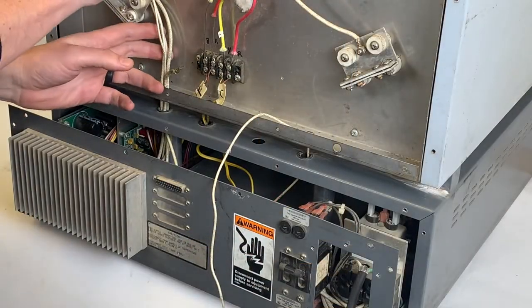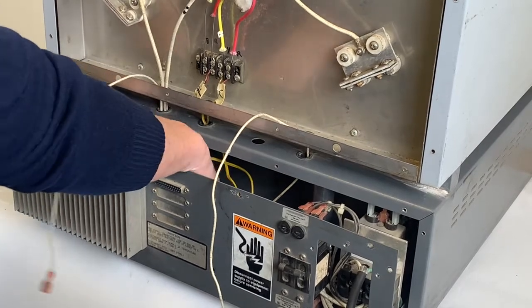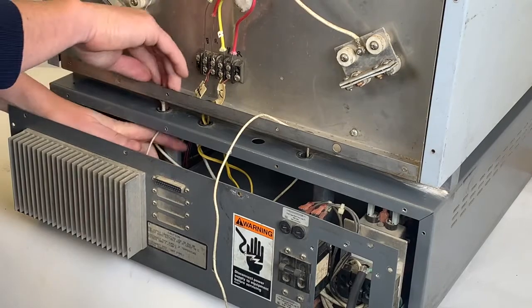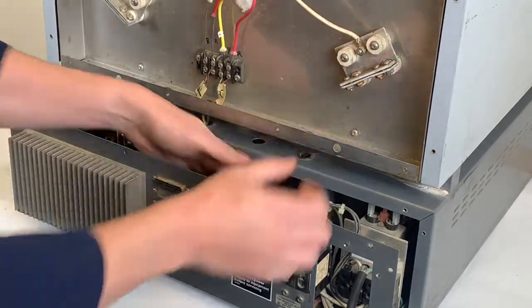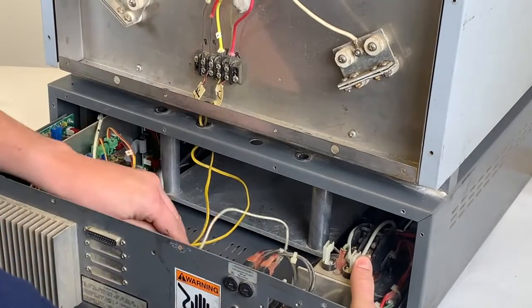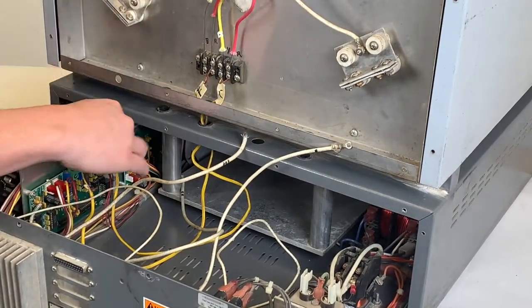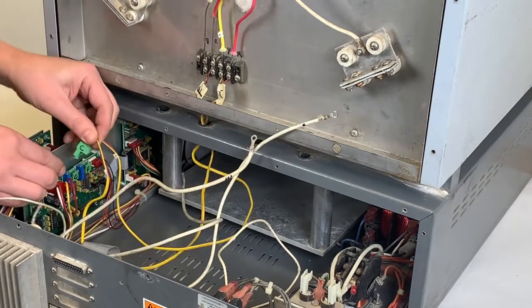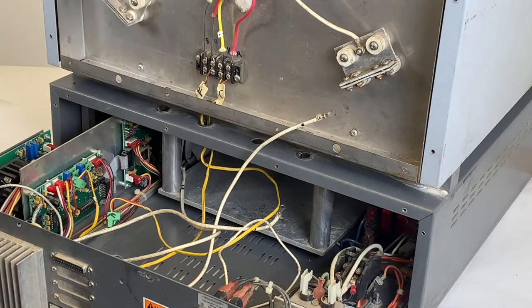Next, we're going to take the element wires and feed them through to the bottom of the tray. All the wires in the back will feed through the small holes to the bottom, as well as any connections and the ground. This will give you access to move the tray further back to access the thermocouples for the furnace and the chamber, which we'll disconnect now as well. We've marked each one with an F and a C to make sure they're put back correctly once we install the ignition front panel. Now that everything is disconnected, we'll remove the entire tray and get started on the next step.